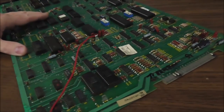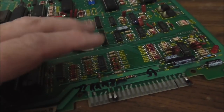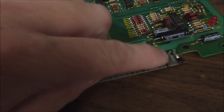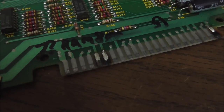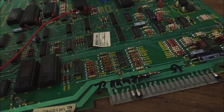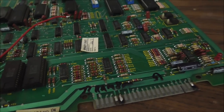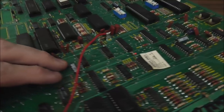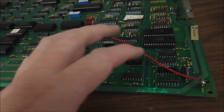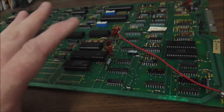So the first thing we're going to check out — I'll just show you the problems that you run into with it. The power was a big problem. The edge connectors would burn up, which was just a typical Atari thing — that always happened on the Atari games. Pole Position, since it's a two board set, just uses more juice. It has two power supplies and two game boards, which causes issues. People have worked on these for a while and one of the things they figured out is that some of the routing of the power rails leaves problems.